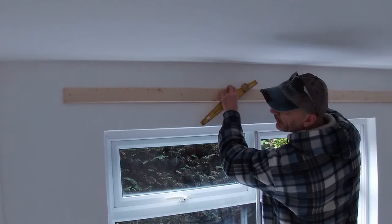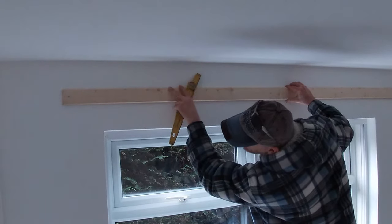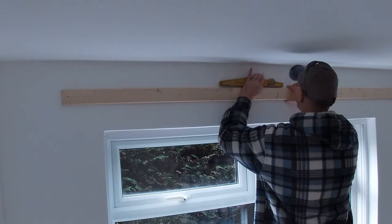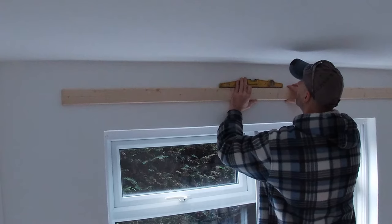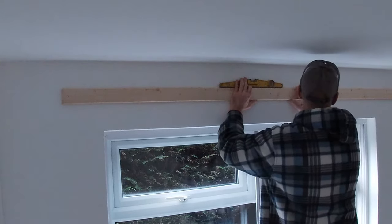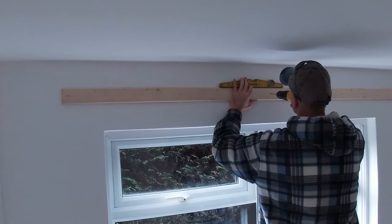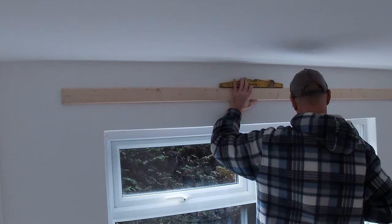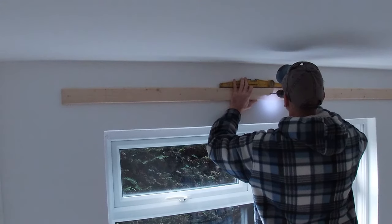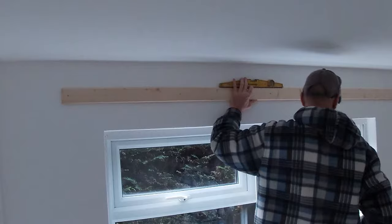So I'm going to position this. My line is on approximately centre, but most importantly the 200mm over the plaster reveal is equal on both sides. You see that pencil mark I mentioned earlier. I'm just going to check my level, make sure we're nice and square. Yep, I'm okay on this side, I'm okay on that side. I'm going to drill the first hole to get me set up, which I've already marked. I'm going to drill that, take it off the hammer. Right, that's my first hole drilled.